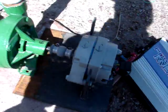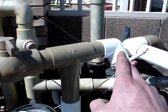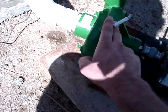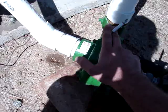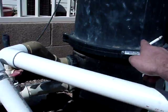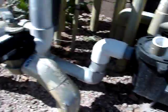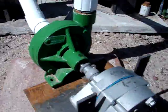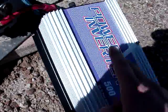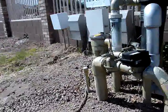I'll show everybody again just to see how it's all together. Right here, comes up right here, comes down. Two-inch port right here. Comes through. This is an inch and three-quarter, comes out like this, comes back in through the cartridges right here, sends it back out. Whatever power it produces — that's negative, that's positive. I don't bother using the pigtail. Goes in this grid tie inverter, 500 watt. Goes right to the side of the pool right there.